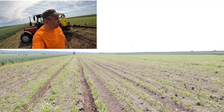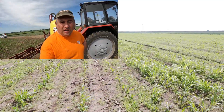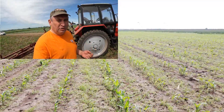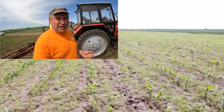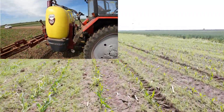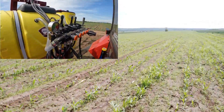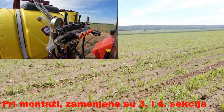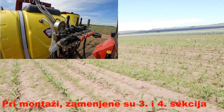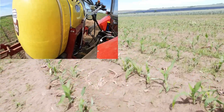I've finished the field — this vegetation has been sprayed. We hope it will go well. First impressions are quite good. One thing that looks a bit strange to me, honestly, is that it seems the pressure is higher than what is shown on the pressure gauge, because these 0.3 nozzles are already creating a serious mist at three bar — that seems a little odd. Also, I noticed that the assembly was not done properly — the rear right section was not shutting off correctly when I tried to deactivate it at the field end. The assemblers didn't do a good job there.